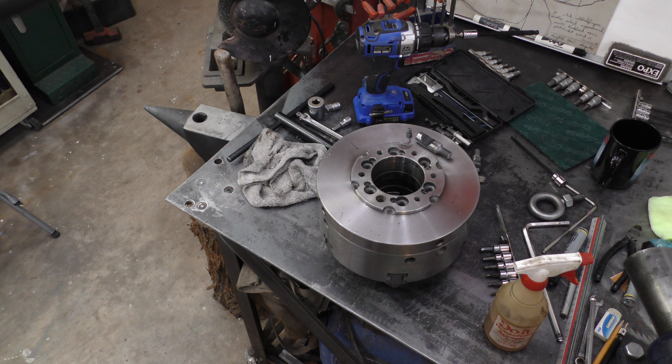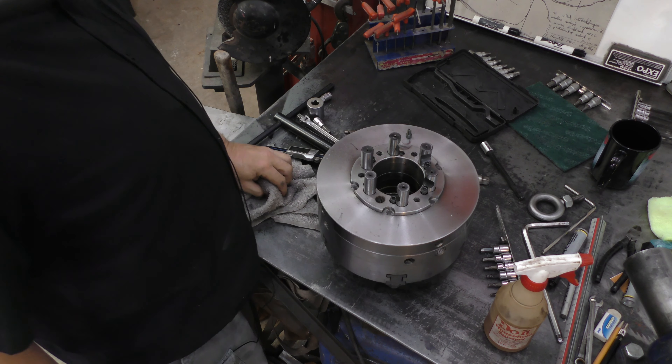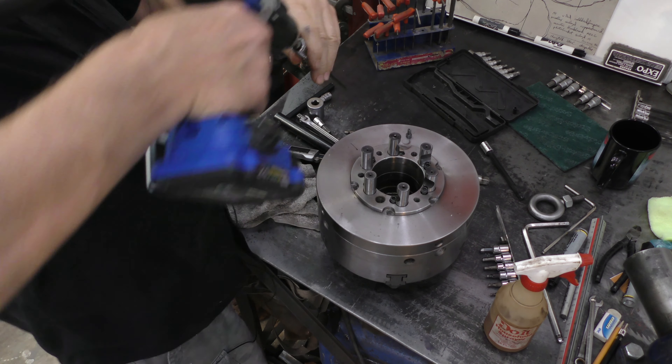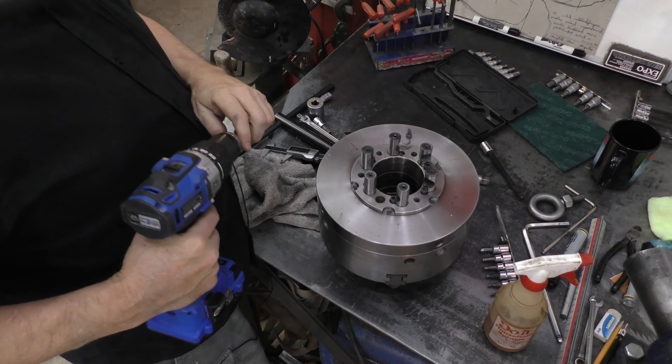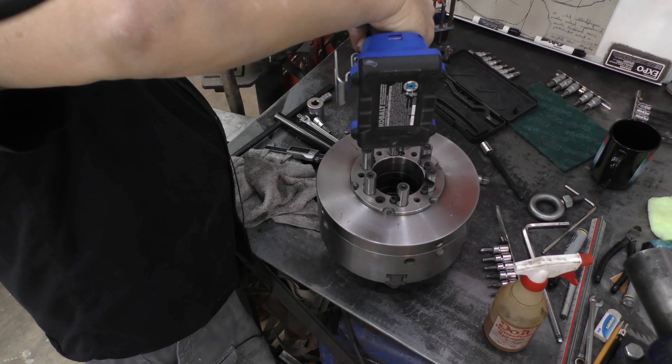Next we have to install the cam followers of the D15 connection, and getting how far you screw them in is kind of a big deal. If you screw them in too far you can't get them to lock properly. If you don't screw them in far enough you can't engage the lock. I measured the heights after they'd already been on the lathe and averaged it — it was 1.51 inches. So off camera I'll install these and get them as close to that on average all the way around before putting the lock bolts in.